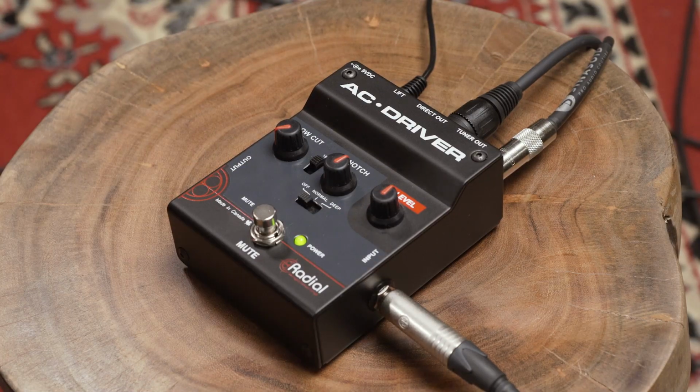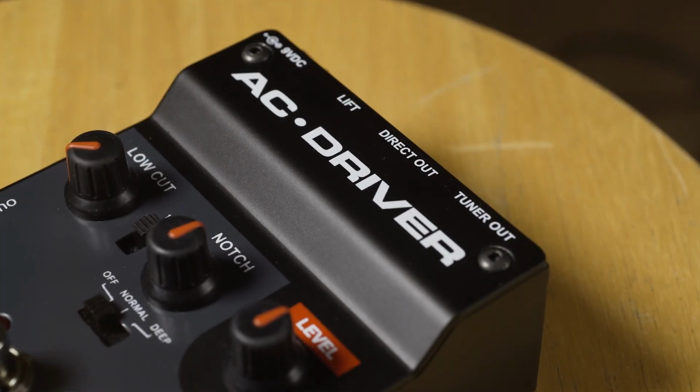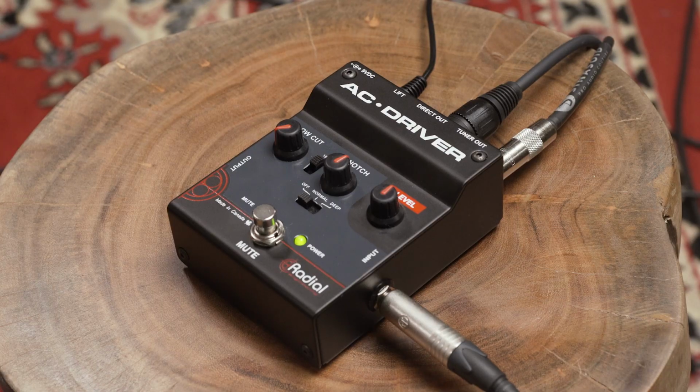It's pretty much just a little tiny box that you could put in your bag and it'll make your acoustic instrument just sound better. It's a preamp for your instrument, so it'll get the weaker sounding output of these instruments and give you a lot more juice to work with and send out to the board or to your amp. It also has a really high 10 mega ohm input impedance, so you'll get the full frequency of your pickups even if you're using those passive piezos.